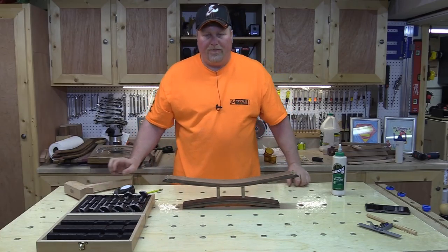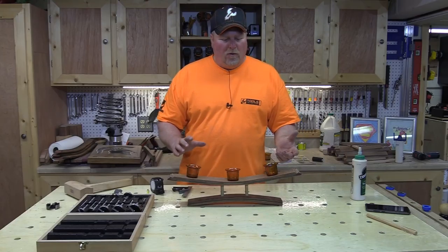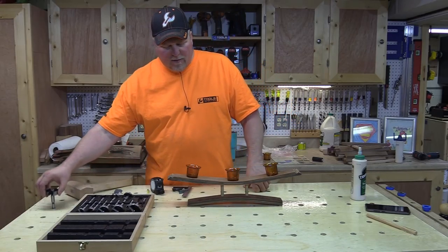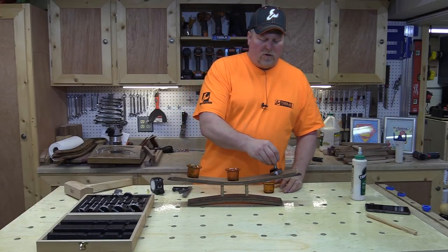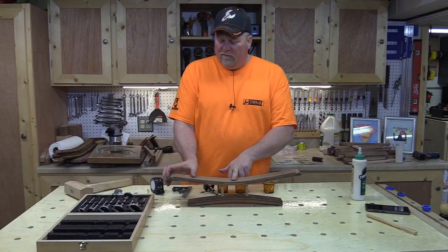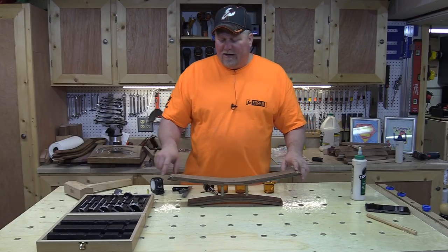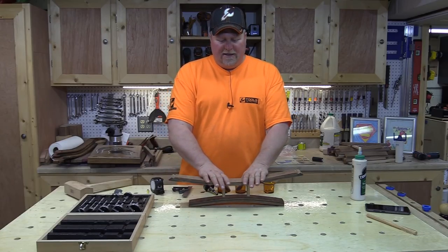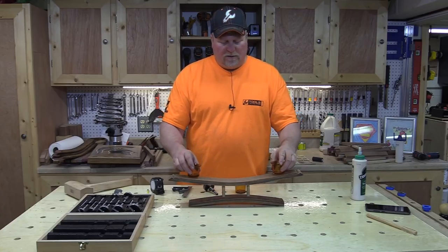We're nice and secure. Now it's time to drill the holes for the candle holders. I decided to go with three — I originally started with five but didn't like the look. I've pre-measured them; they are approximately two inches at the bottom and taper up, so I'm going with a two-inch flat-bottom hole. They're measured dead center, four inches off each edge with a string line through the middle. Now we'll take it to the drill press and drill the holes straight up and down so the tea lights will sit level.